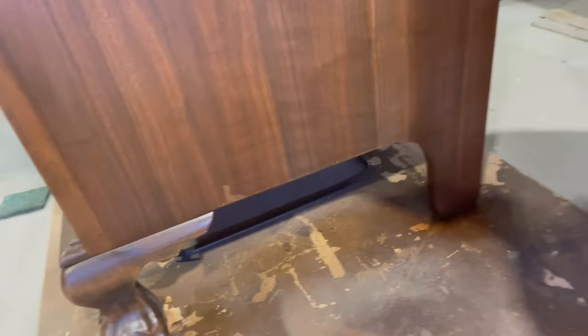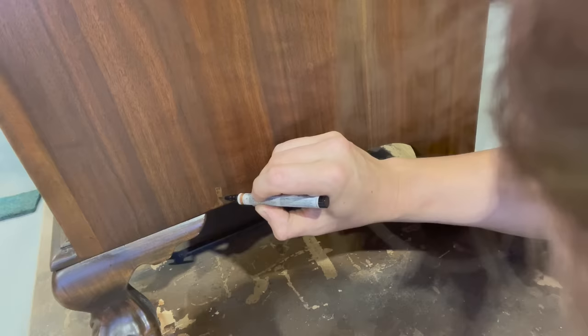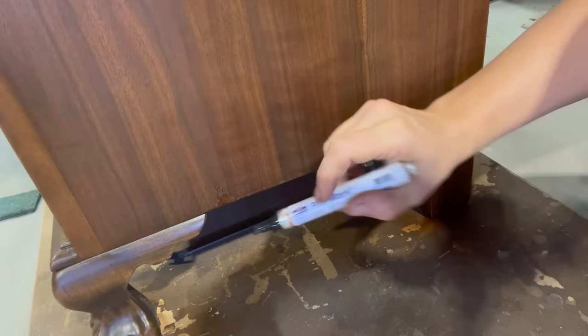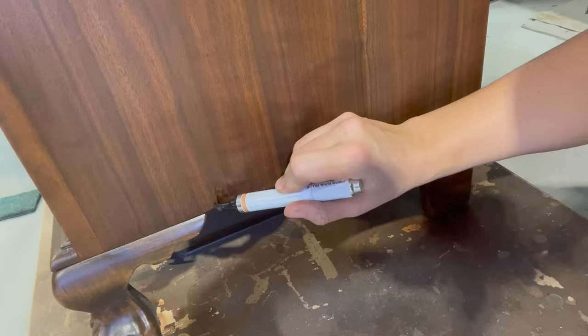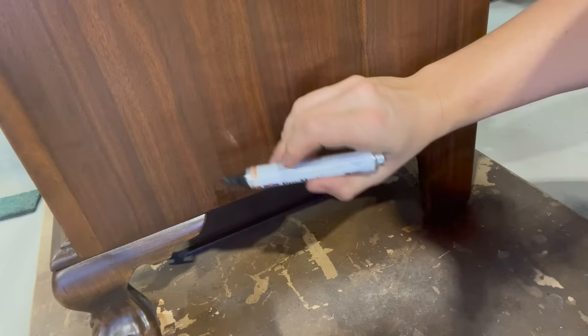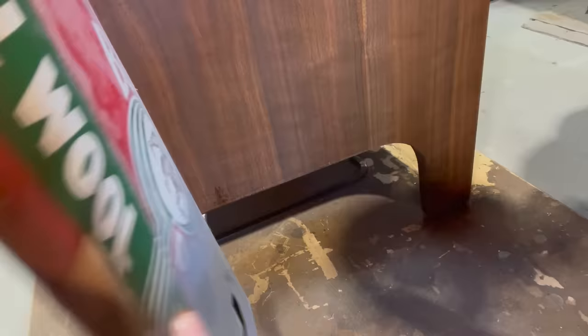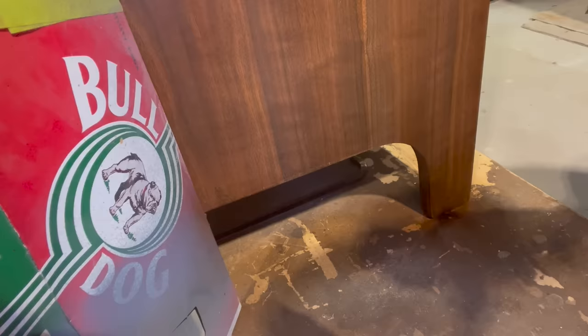Right here, we've got a veneer repair that we did. Red pigment over top of that. Really be careful to not go too harsh in a line anywhere. And then same thing, I'll protect this leg a little bit and just slightly hit that area with the fiddle tone and the raw umber. And then I'll blend it into that leg there.